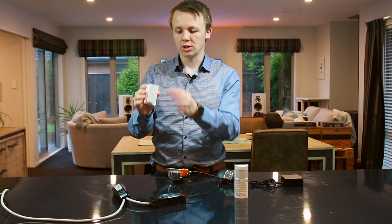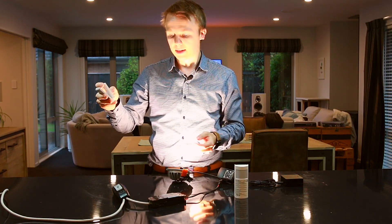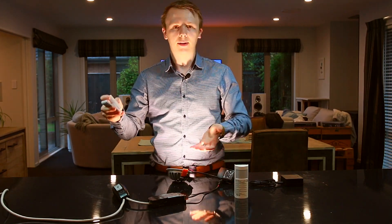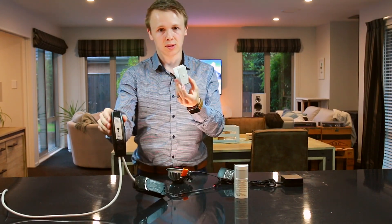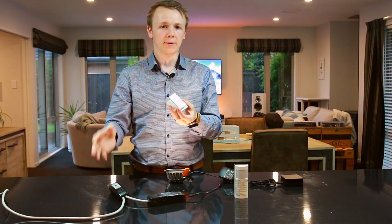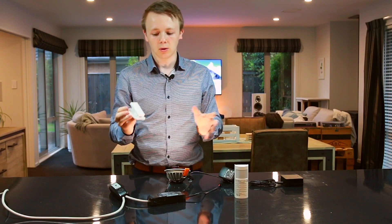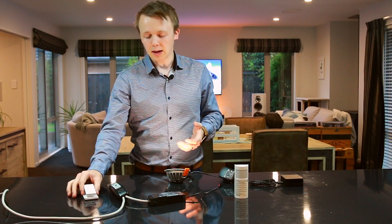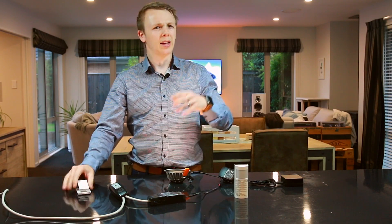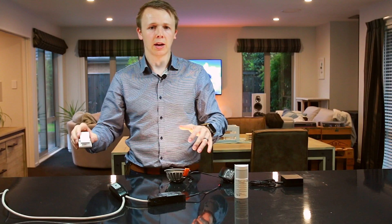To give you an example — I just hit this button here. It immediately turns on. If I hold the down button it's going to dim down. This communicates to the driver with radio waves. It's a very specific frequency determined by Lutron. It doesn't interfere with Wi-Fi, Bluetooth, cell signal or anything like that, and it's completely discrete as well. It's not hackable like Bluetooth or Wi-Fi where you could dial into it and control things. It's just a completely discrete code and it's one-way communication.